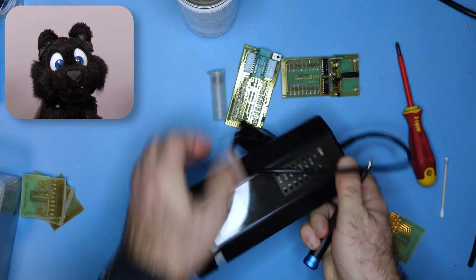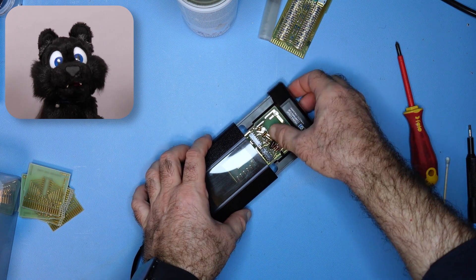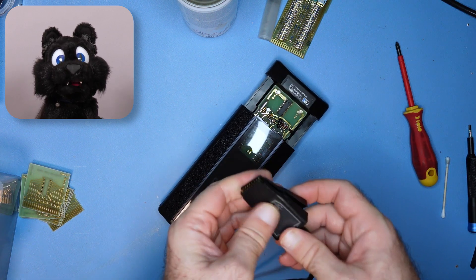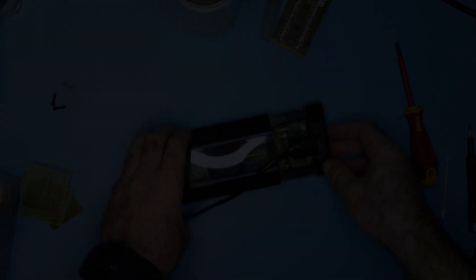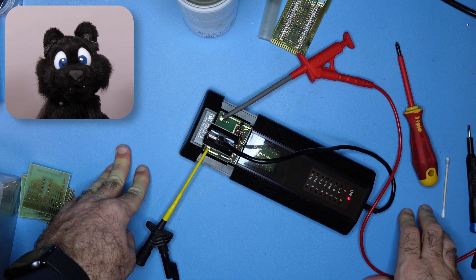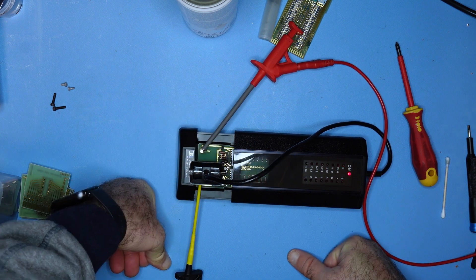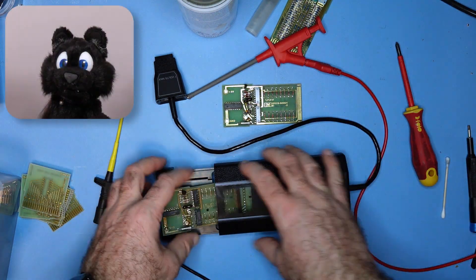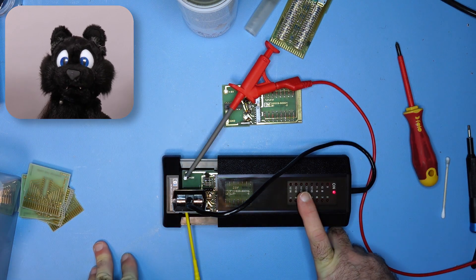Function check time! How does one validate the validation device? It comes with a self-test PCB. This one sticks out quite a bit and provides a dummy IC for the test clip and a 5V power supply hookup. All the LEDs should blink in unison, but there's one that is out on mine — bummer! Let's try the second self-test card before I dig into it. Indeed, pin 14 is out!